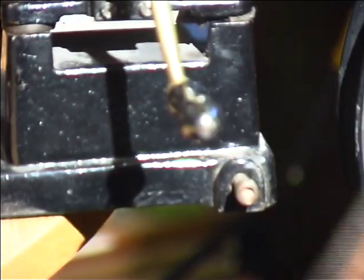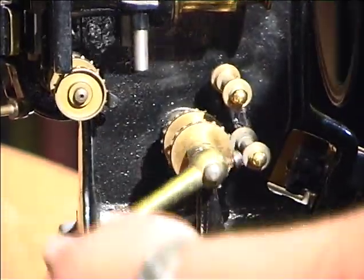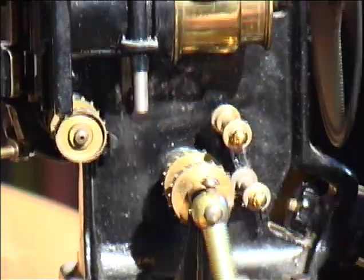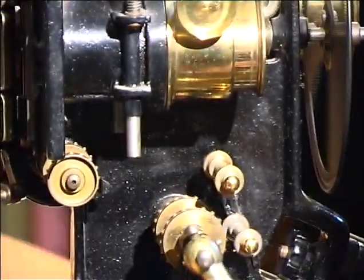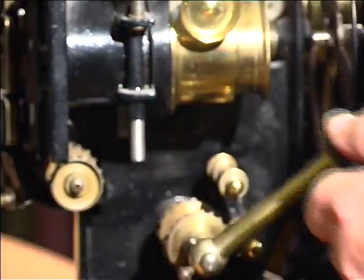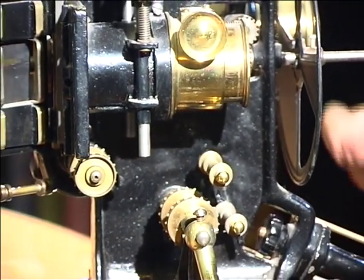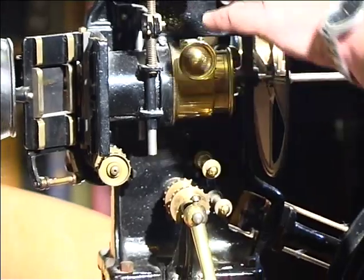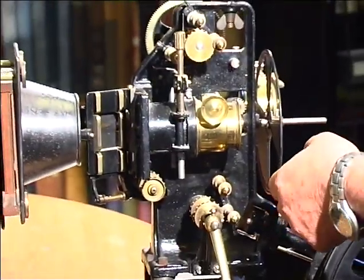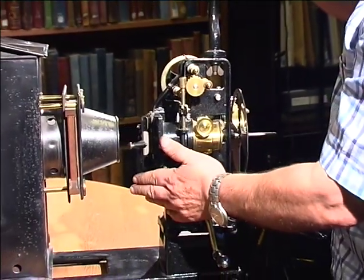Now, when you think about it, when you've got film in and you're cranking this on, you don't want it travelling about on the floor or on a table. So it's very smooth, beautiful projector. And I've actually laced this one before and I found it quite difficult to set up. And I think the reason is that early film, which was nitrate, was much stiffer than modern film, which we are using, so the loop collapses. I'll show you that in a minute.